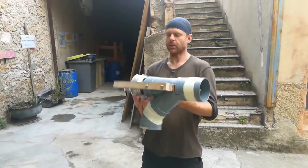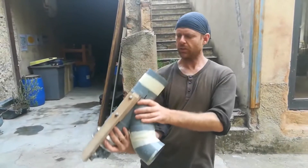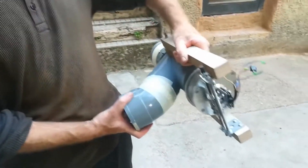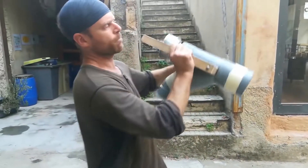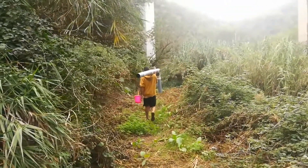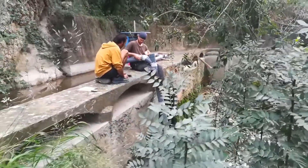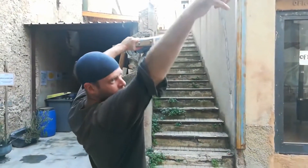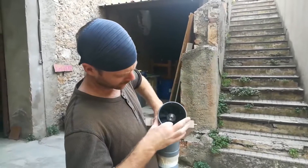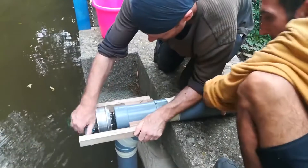This is the phase 3 turbine. It's similar to the previous ones that we tested. I'm going to flip it around direction-wise, so that the water is going to come in from here. We're going to move it further down the canal with about a 2.2 meter drop instead of a 0.9 meter drop, which should give like three, three and a half times as much power overall. The water's going to come up here, go through here across the top of the rear and then vertically down — horizontal — and then the water's going to come up this way, turn the fan, and then the pipe's going to plug in here on the floor. Other than that, it's basically the same.